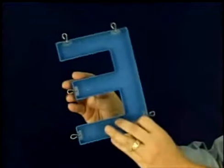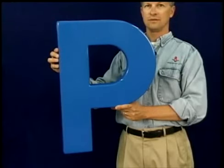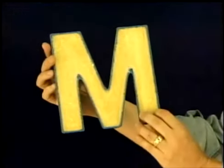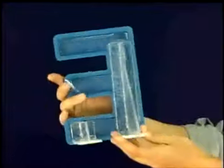Use PBO or wire if letters need to be moved soon. PBOs on letters over 24 inches high will be sent loose. Foam fill is used on letters up to 9 inches only. Use a tie back on freestanding letters over 15 inches high.